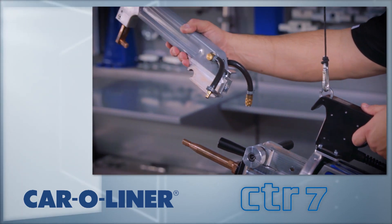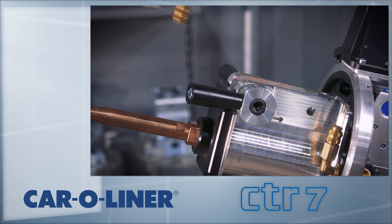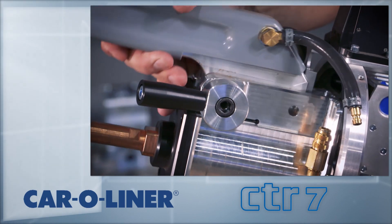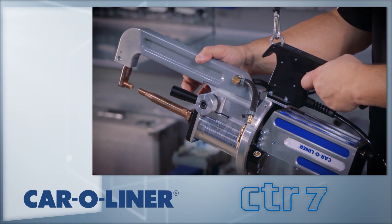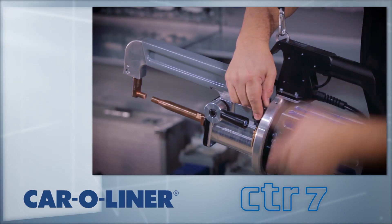Pull the C-arm out from the front of the gun. To reinstall, insert at a 30-degree angle until it reaches the hinge pin. Then rock the arm down into place. Turn the locking handle, making sure it is tight, and reconnect the hoses.